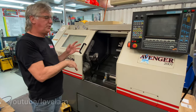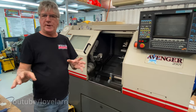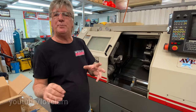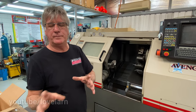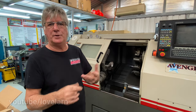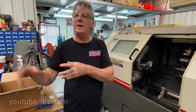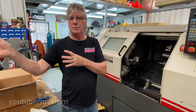And the finishing, because once roughing is done, and the reel is nice and even, I rough them with a certain radius insert. And they're a specific insert, extremely expensive, and they don't last that long. A lot of experimentation to find the right inserts and the setup and the way I do them. So once rough cutting takes place, then they're ready to prime and paint. I think I missed that out before. They're ready to prime and paint. So they go out primed, painted, then they're ready for the final finishing.